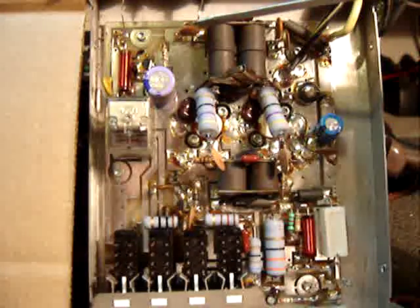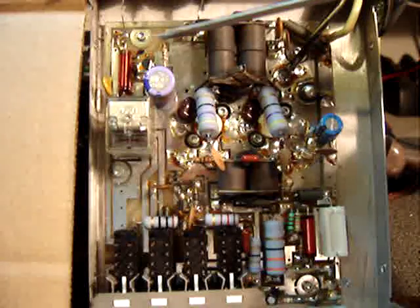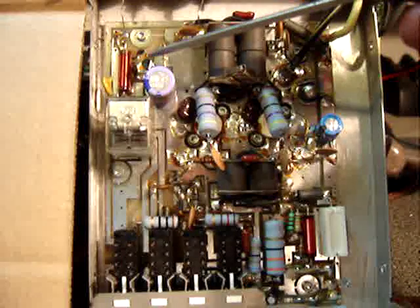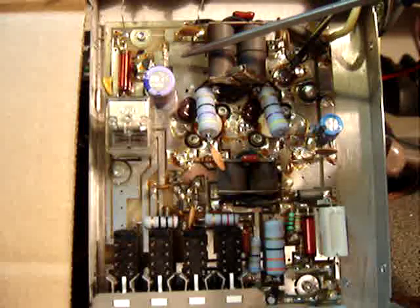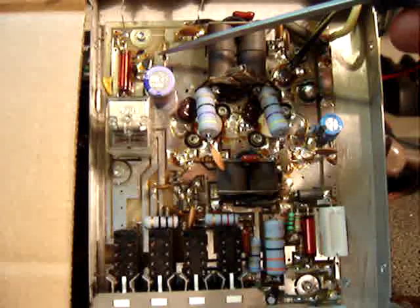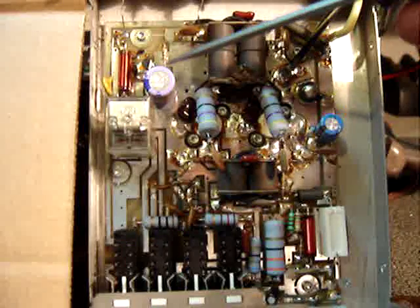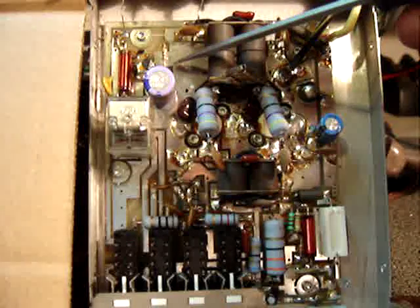This is the basic amplifier board used on most Texas Star amplifiers. In the back left corner we have the relay and the keying circuit. We typically use a 2N2907A keying transistor. To manually key up without RF, take this 470 ohm resistor and effectively we're shorting the emitter of the transistor to the ground pad.